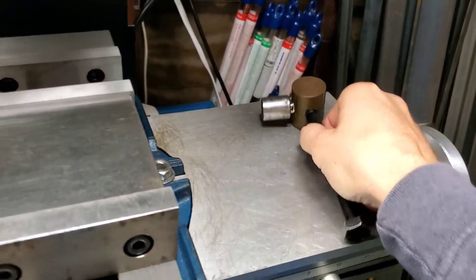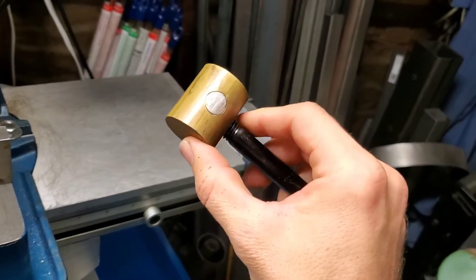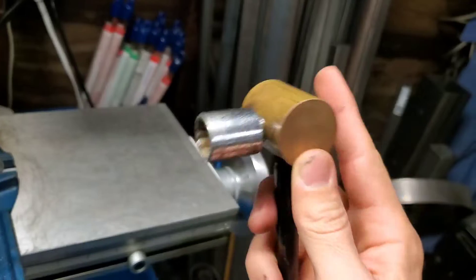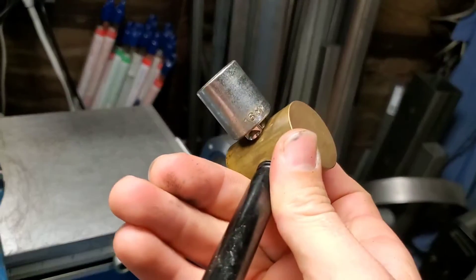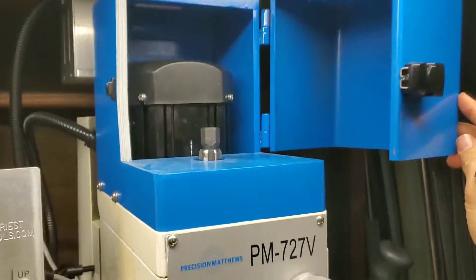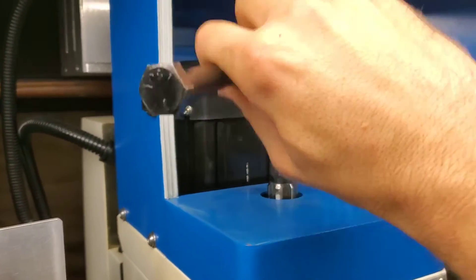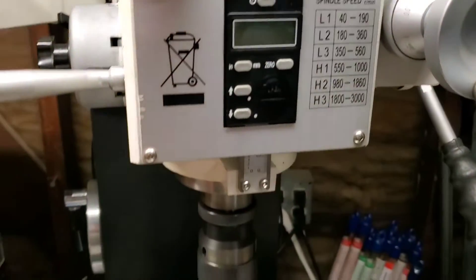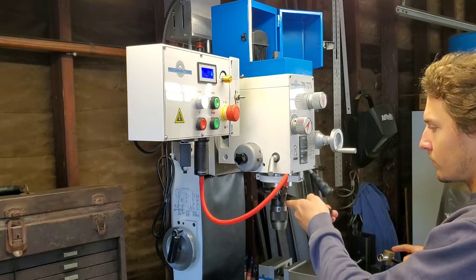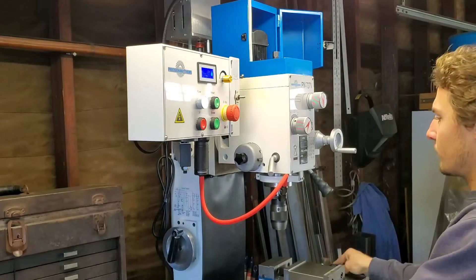Hammer wrench — this is a great machining project. It's a hex bolt threaded into a brass slug, with a hole drilled for a socket extender that I pressed in and ground flush. You can change the sockets on it; it's 16mm for this drawbar. The way it works: you open the door, there's the drawbar and the motor, and this makes tool changes a lot quicker — loosen it, tap it, get your tool out.